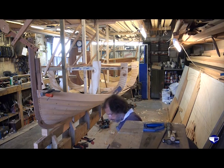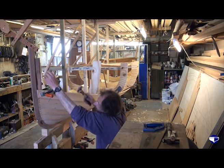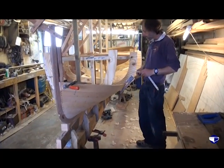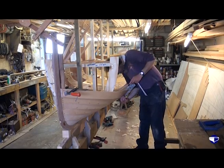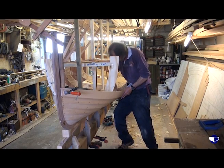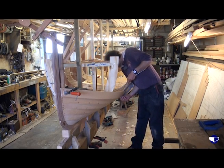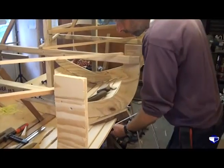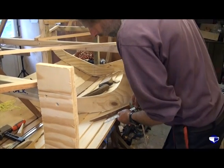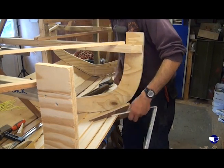That's just pinged in. If we tap it down at the front, it's not far out of line. Then we can just measure our overlap - see what overlap we've got. Ease our plank in, stick a wedge. We've got three and seven eighths there, so we need three and an eighth showing on the inside to give us our overlap.